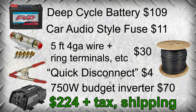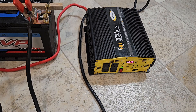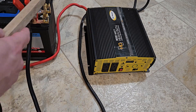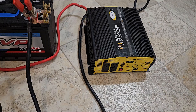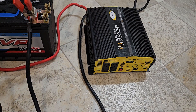Cable, connectors, a mid-range inverter, and a battery — you're looking at under $300, or maybe $400 if you really want to do it right. Let's see if it works. Switch it on — with no fans running it takes under 10 watts just to sit idle. And my cutoff switch is sufficient. There's a lot of residual power in the capacitors. Because I just emptied them, we're going to get a spark when I turn this back on — it draws a lot all at once while loading the capacitors. Not really dangerous if you see that; it doesn't mean you shorted it out or did anything wrong.